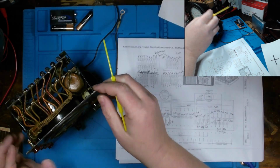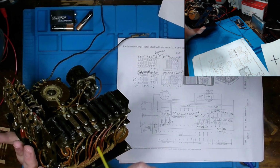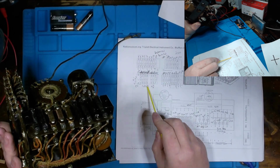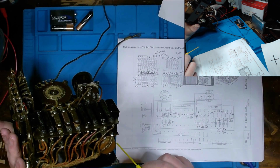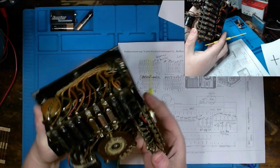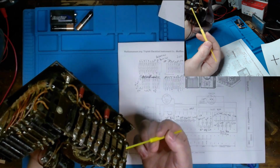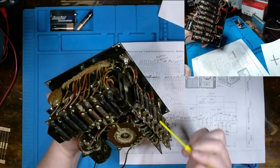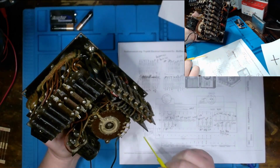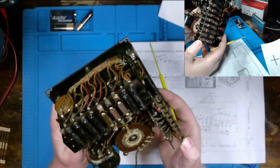Anyways, concerning the resistors that we have, everything on this placard here, all those values, including these dog bone resistors, were within 1% of their assigned value. So that was really nice to find out. However, for the most part, these wire wound resistors that you see here built in this fashion were roughly 1%, and a few were at 5% of their values. But for the most part, they were within 1% of their assigned value. And then obviously this one that is broken away, we'll solder back down. We'll actually do that here in a second.